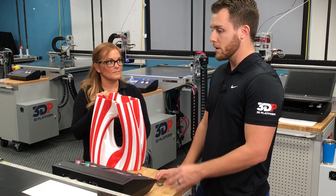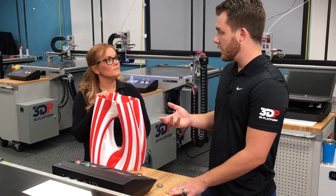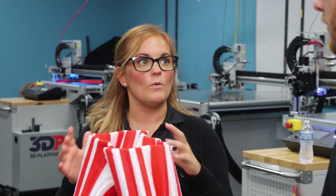So with the two nozzles on there, when you set it up, what's the unalignment that can happen? There's a tolerance stack-up with the extruders actually mounted on the machine, and within that tolerance stack-up is where the tips of your nozzles may not be perfectly aligned. So you're going to run this print — it's called dual nozzle calibration. Once it's printed, you take a measurement of the X and Y offset. And we also have a calculator available on our website that will give you the offsets that you program back into the controller.